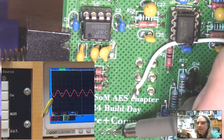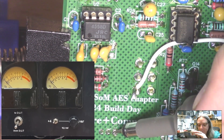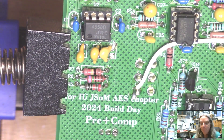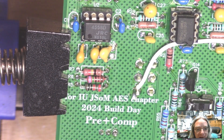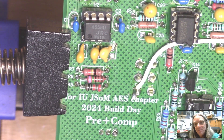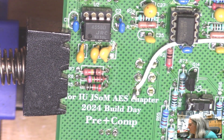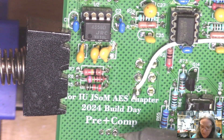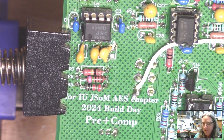As I connect that lead, I start getting output because it's bridging the potentiometer lead and the PCB. So I'm going to turn it off and solder that. I didn't have my soldering iron on so we'll give it a minute to warm up. But that's the process: put signal in, find a halfway point, test it. If you've got signal there, you know it's the second half of the circuit that's the problem. If you don't have it there, you know the problem is in the first half. You don't necessarily know the second half is okay, but you know the first half is at least okay.